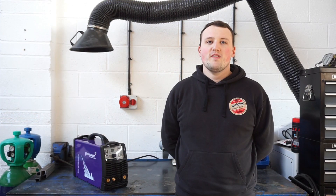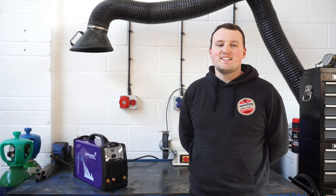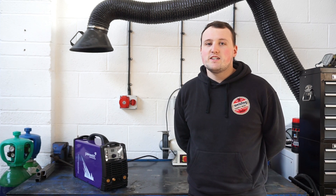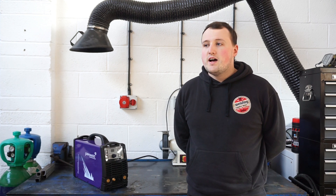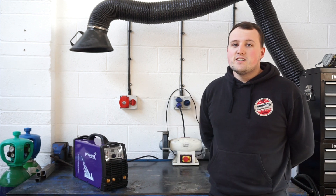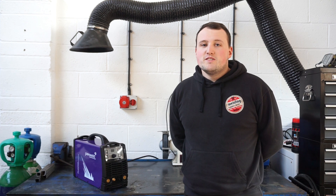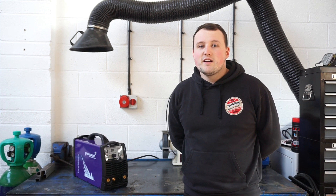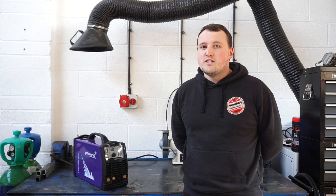Concluding comments on the Powerweld XTT212: overall it's a really good quality, compact AC-DC TIG. At only 12 kilos it's a big advantage especially for site work, and combined with dual voltage input between 110 volt and 240 volt, it's perfect for the on-site welder. The control panel is really intuitive and easy to use, the features are brilliant and useful, and the top quality accessories make it a perfect solution for someone in the market for a 200 amp AC-DC under £1,000. For more information, check out our website or call 01952 582 260.